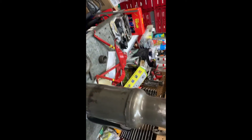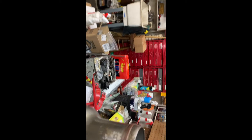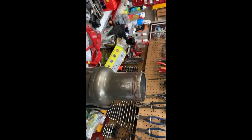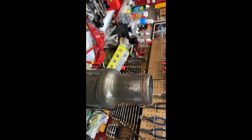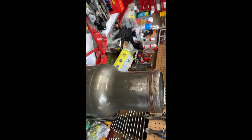The canister floats around a little bit, so I was trying to get it centered and couldn't think of a good way. Then it dawned on me: if I take some really skinny O-rings and put them around the tube, it'll center the tube. It also gives it more layers the fluid would have to leak through in order to get past the seal.